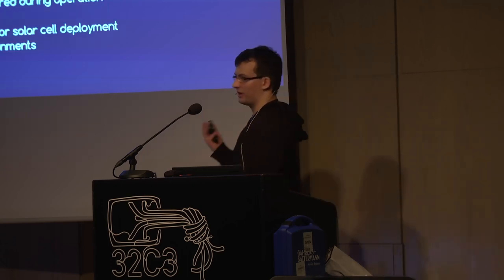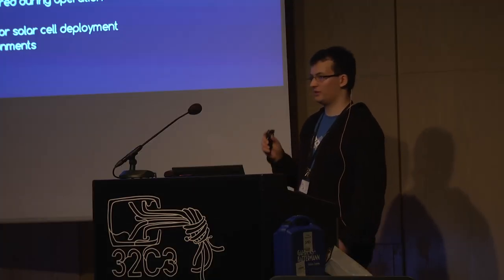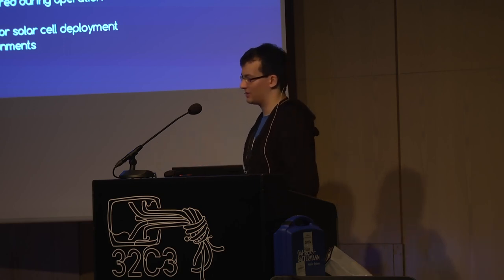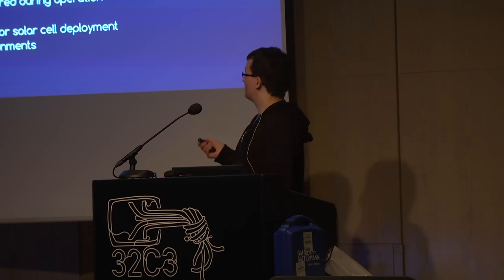What are common verification methods? For launch vibration — which is much more severe than static G-loads — you could read the launch vehicle manual, as nearly any major commercial satellite launcher has a publicly available user manual. However, those give a vibration profile meant for the main payload, not for your CubeSat mounted elsewhere on the upper stage. It's better to look at your CubeSat launch provider's documents, which specify an acceptance level you must withstand. For mechanisms, it's important to test under conditions you might actually encounter in space — after launch shaking, at the temperature profiles in space, under vacuum, and at low battery levels.